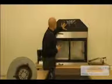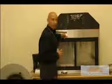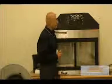High temperature refrigeration is actually used for home comfort cooling. This other machine here, which is next to our coffee maker, is actually a low temperature cooler. This one has the compressor on top, as well as the condenser, and your evaporator is inside of here, which also provides low temperature cooling.